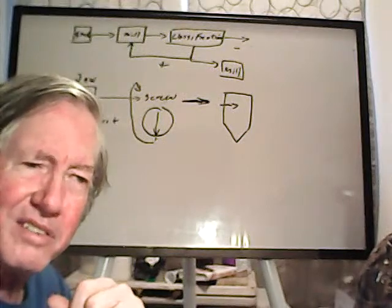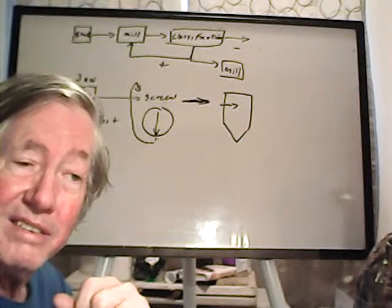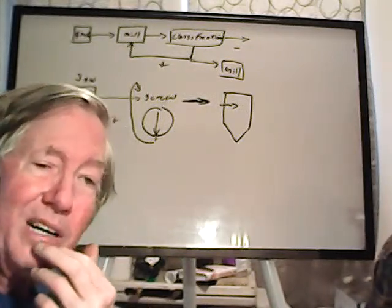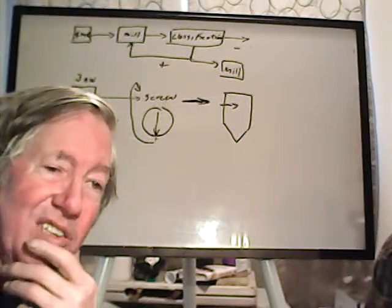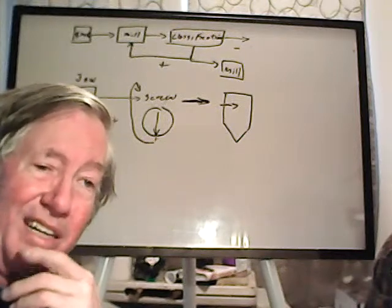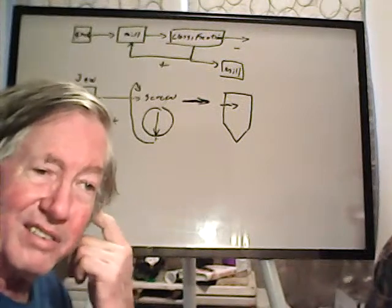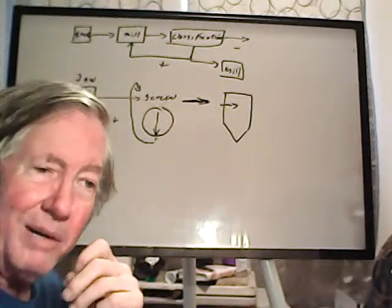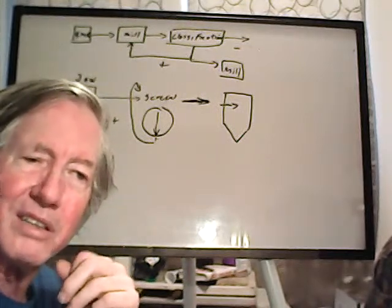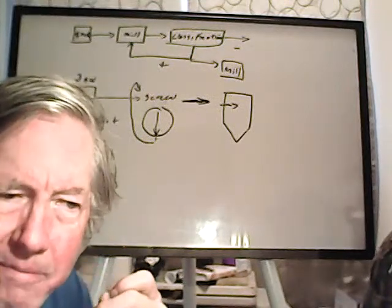Another thing I was thinking, Chris, is to basically just throw an extra half an ohm or an ohm on there and cut the amperage down, drop the temperature by 100 or 200 degrees. We're running 1900 degrees max right now, and the thing's supposed to go up to 2200. So if we drop 100 or 200 on the heating element temperature, I think it would still work. But that's an interesting question. What do you think, Chris?